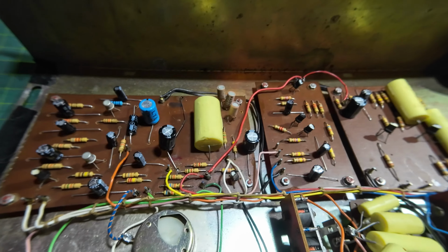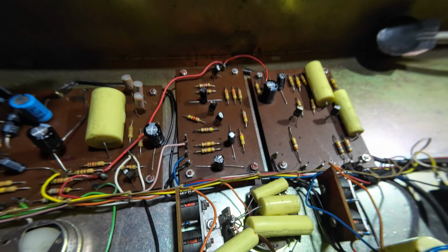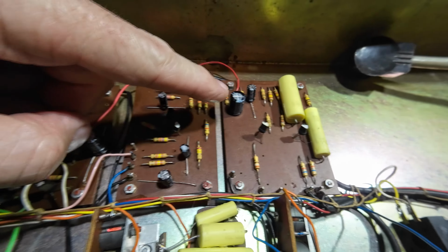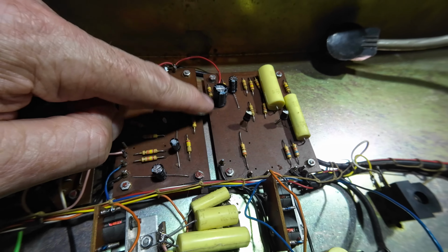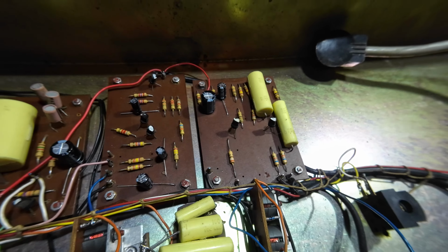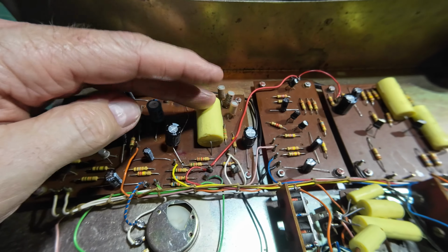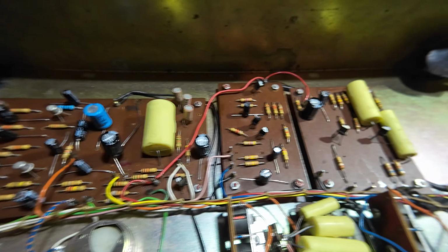And if you go on the Vox showroom website, there's actually a picture of the preamp section, and you can see the guy's recapped it, made a smashing job of it. He's used all axial capacitors. Radials don't belong in here, apart from this one, which must have been a radial, because it's solid and the pins are close together, so they fit the holes in the board. So I'm going to take these boards up, if I can find these capacitors. I'm going to test these and change them if they're no good. I'm leaving them if they're not.